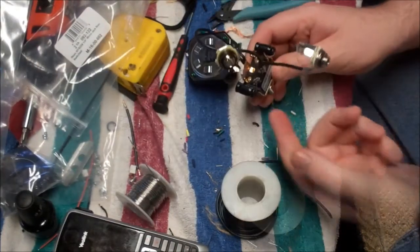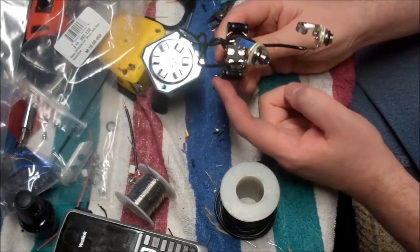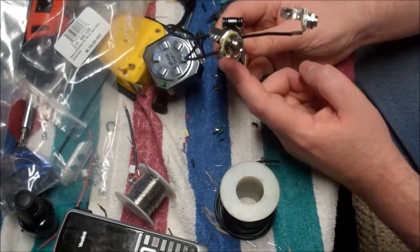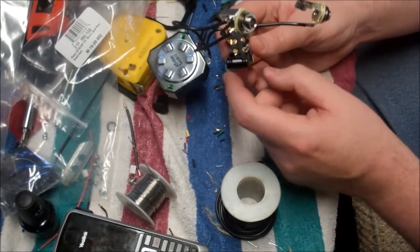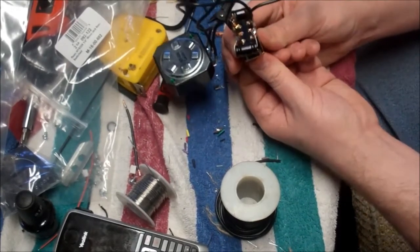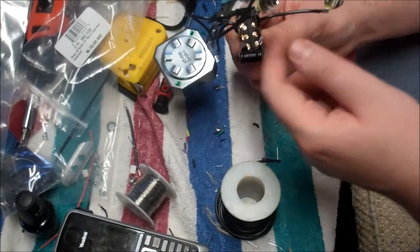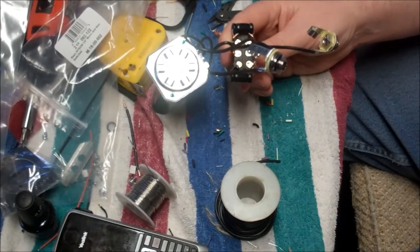Okay, so if you don't understand what the deal is with the bright switch, if you recall, certain frequencies, AC high frequencies above a certain point, can pass through given capacitors with ease. DC and lower frequencies cannot. So what we're effectively doing, by flipping the switch to one direction or the other, is throwing this capacitor into the circuit, allowing the higher frequencies to bypass the L pad before getting to the output. That's why we call it a bright switch. So that looks like it's wired up, and we're going to stick it in the box and we'll see if it works.